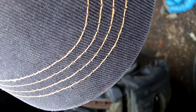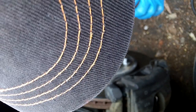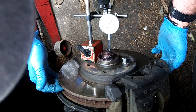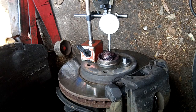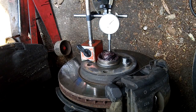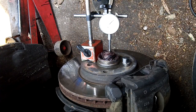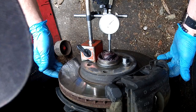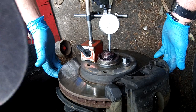Remember, this is only supposed to move one notch. I've got to center this exactly at zero. Okay, I'm going to pull — that's about half of one thou, which is good. And push — which is a little less. We've actually got a little less movement than we want, just the tiniest bit less. So I'm going to slightly loosen the bearing retainer like a millimeter — it's very minute.